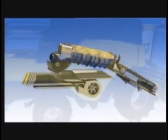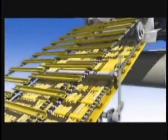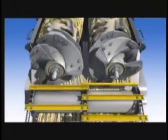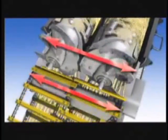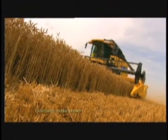First, feeding a combine's rotors is critical. The CR Twin Rotor Combine's feeding system is unique. The CR's undershot feeding system releases the crop just underneath the rotor augers, ensuring the rotors draw the crop evenly from the feeder, maximizing the feeding process. The crop enters the feeder house head first and feeds easily because the width of the feeder housing is equal to the width of the rotors, which means the crop does not converge or hesitate when being drawn in by the rotors. Easier feeding means efficiency right from the start.